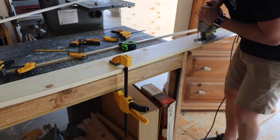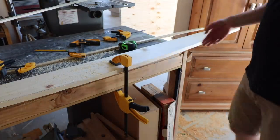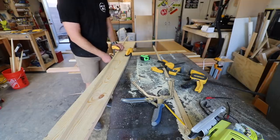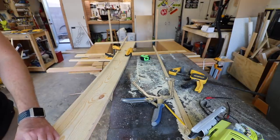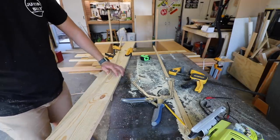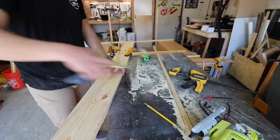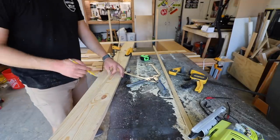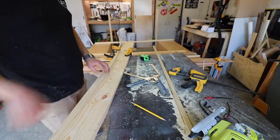I'm working on the arches here. There are four total, and I went with arches so that it'd be better for structural support of the roof, aerodynamics, and wicking water when it rains or snows. The way I achieved the curves was to measure the endpoints on each side and then bend a piece of wood I could trace along to get an even enough curve. It wasn't an exact science, but I think it turned out okay — looks pretty good.